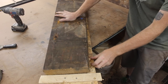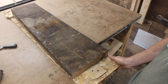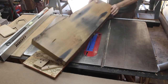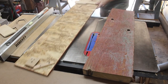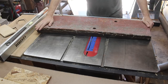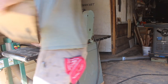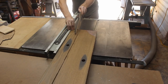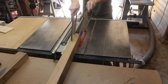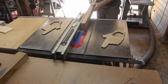Here for example is a white oak plank — it's not warped, it was actually cut into the shape of the boat, so it takes some effort to make it flat and level. I set up a sled to level out one side so I could flip it and level the other side. You also have to watch out for the paint — it's a copper-based paint that goes in the hull of the boat. So you want to safety up while you run it through the machines and get that dust out of there. I had fans blowing and dust collection on. Once you work your way through it there's some really beautiful wood with an iron acetate stain from the iron spikes and salt water mixing together over the years.